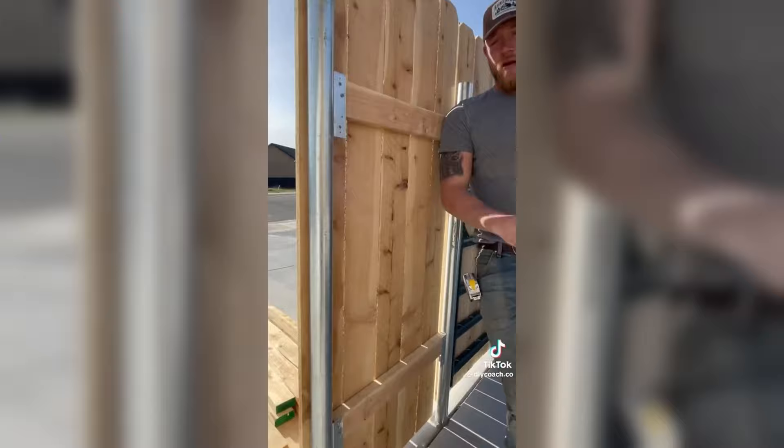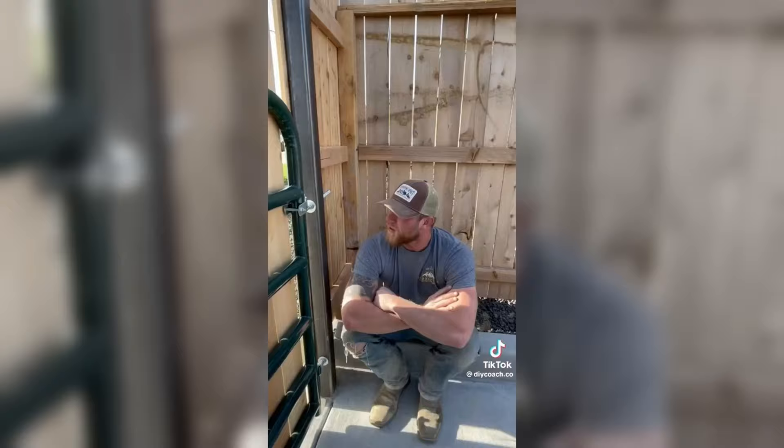If you want to do a quality job and you're doing a fence that's poured in the driveway, you use metal posts. Always. Or bolt one to the concrete. Here we have a three-inch by three-inch, quarter-inch steel post two and a half feet in the ground. Steel posts — 100%. Nailed that.